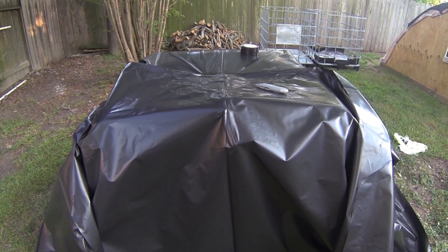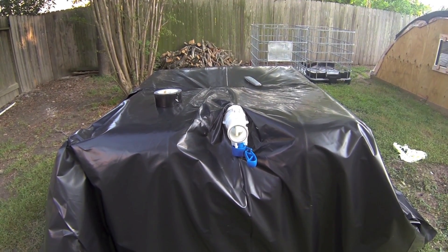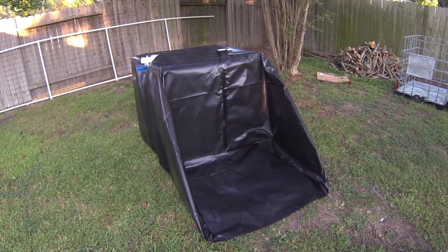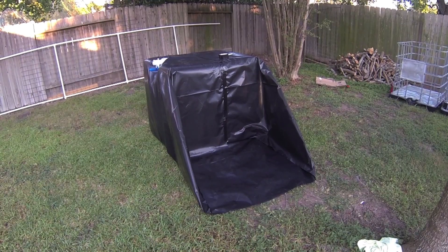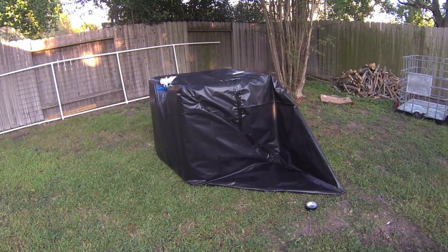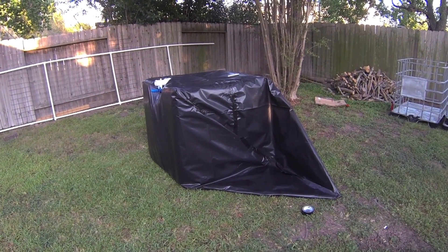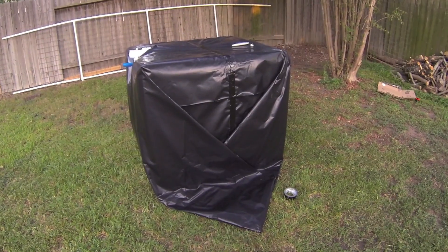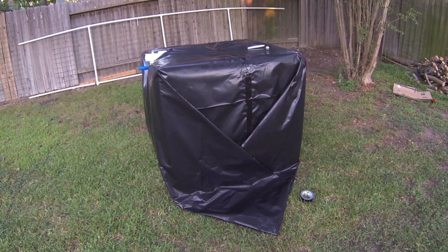With the tank upside down in the center of the plastic sheet, basically all you're going to do is wrap it like a huge present. You'll only be making one cut — where your valve is — to allow the valve to fit through the plastic. You'll notice a seam line on both the plastic and the tank that match up well; that seam line is directly in the middle, so lining them up makes wrapping much easier. When wrapping, it doesn't have to be pretty. Just make sure you block all the sunlight and tape all your seams. If you tape them well so no water can enter, everything should hold no matter what it looks like. Once it's back in the cage you won't be able to tell.